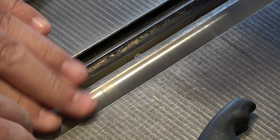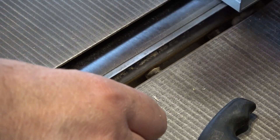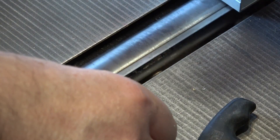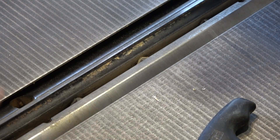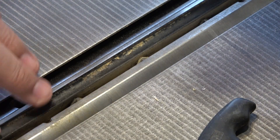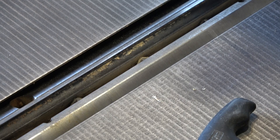So time to look at the process in full. I've already done two blades so this is the last one, and the first job is actually just to check to see where the blades are set — whether they're high, low, or what. In this case it's below the level of the table. So if you're fitting a new blade, this is where you actually want to start. Push those screws in a little bit so the blade starts too low, because it's a lot easier to work the blade outwards and keep measuring it until you get it right.